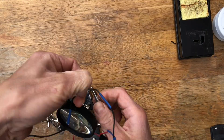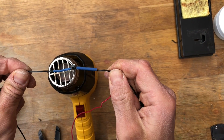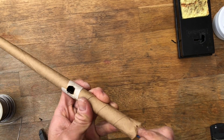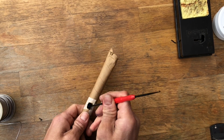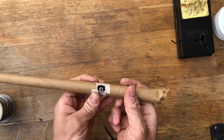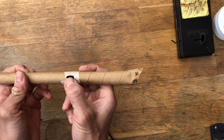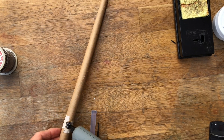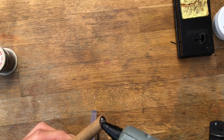Strip the ends of the clipped wire, then solder the button to both clipped wires, or use electrical tape to secure the wires to the button. Insert the entire LED-button-battery assembly into the wand from the handle, LED end first. Fish out the button through the hole using a bent paper clip or tweezers. If you only secured the button using electrical tape, take care not to remove the connection between the button and wires. If you have a hot glue gun, glue the button so it doesn't fall inside when pressed, and secure the light to the top of the wand with the hot glue gun.